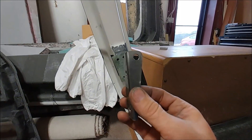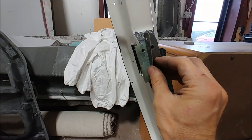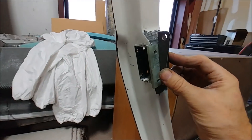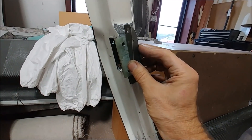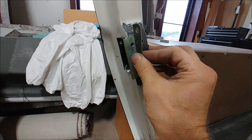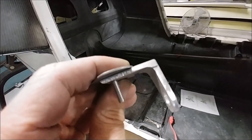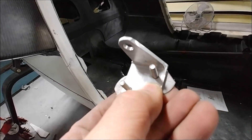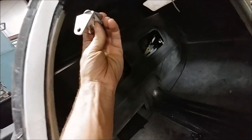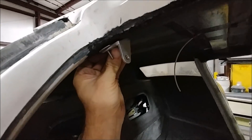There are always other background projects going on that you don't always get to see. This is a bracket that's going to attach for the gas strut to hold the door open — one for each door. Those are just 50-thou thick chromoly 4130 steel. This door is going to have a carbon fiber layup over the top, and then the bracket goes over that, so it'll look neat and tidy when done. This is the bracket made from angle aluminum, cut to shape with some weld mounts, going to be glued and laid up over the top — bonded on the inside of the door frame and fuselage.